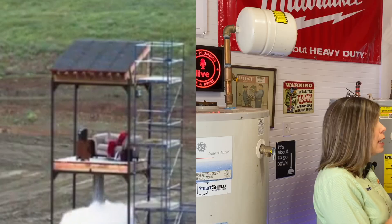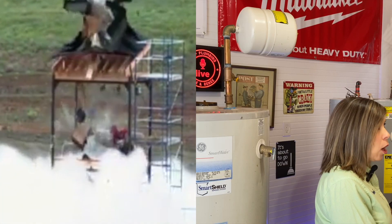The most important thing is: if your drain is leaking outside, do not put a cap on it. It basically turns your water heater into a bomb. So I repeat, do not cap the line off — you can have a bomb and a flood.